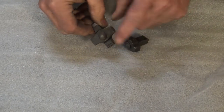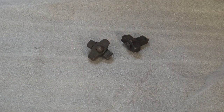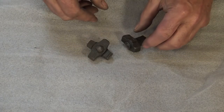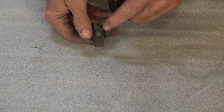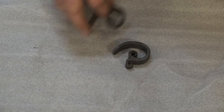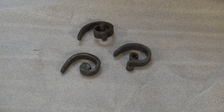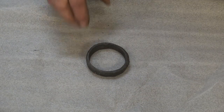Do some little joinery practice. The rivet on this one was a regular rivet — I did not make the rivet out of the bar, and I think that's reasonable. If you need a rivet or a wooden handle for a tool, making that separate is fine. But the majority of the piece, all the key components, should be made out of half-by-half-by-three. You can make little scrolls, or a ring by splitting down the middle of the bar and opening it up, or a little split bar cross — that was kind of fun.